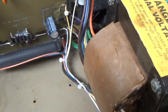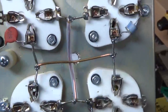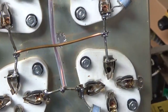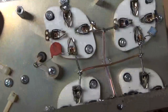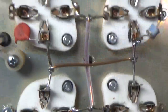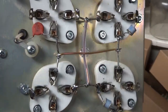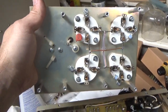I added the wire for the bias mod and the string of diodes. Replaced the mica caps for the 10 meter input circuit. Replaced two of the wires for the tube sockets — the two that are now solid copper, non-plated — and put a piece of Teflon tube over one of them. They were just laying across the other wire where they were soldered; now it's around and crimped and all set. Connected each grid connection, one per tube socket right to the chassis. Compressed the socket clips, fixed other solder joints, and also added the two gas discharge tubes.